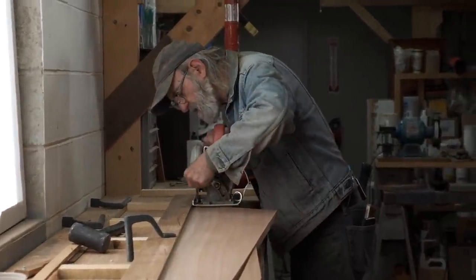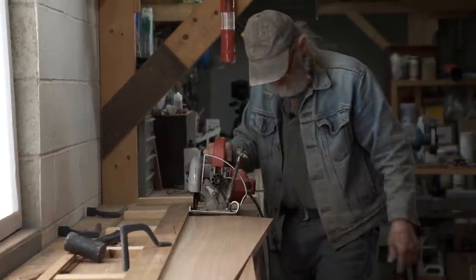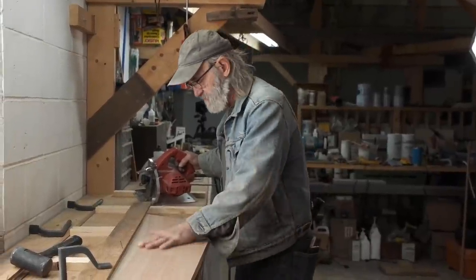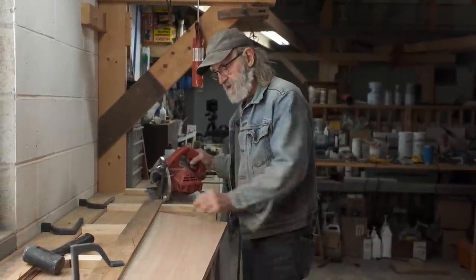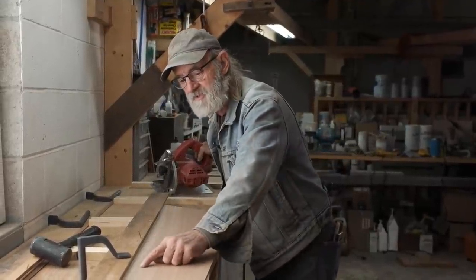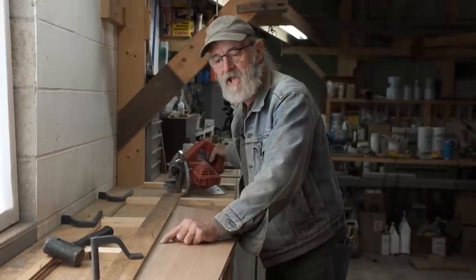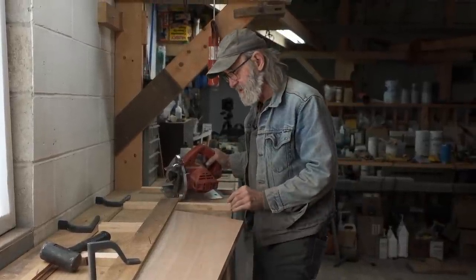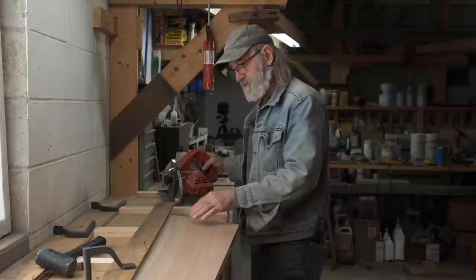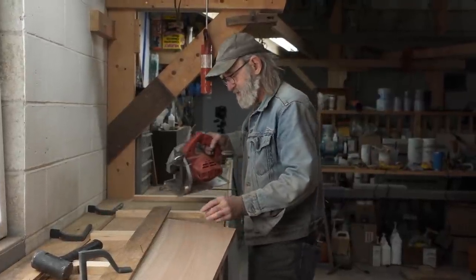Okay, I'm going to pick up this saw, slam it up against the batten, and make sure that my guard is up to start and we're not plugged in. So now all we have to do is pick up the saw and follow the batten, and we can watch it as it goes by the marks to see if it's cutting the marks in half. Usually it'll cut that pencil mark right in half, just as perfectly as can be. And you know, I don't think we'll ever have to touch that cut up with a plane or do anything like that. So here we go.